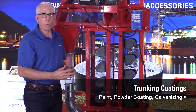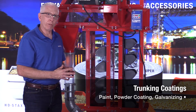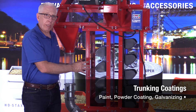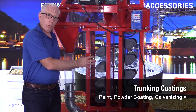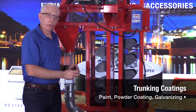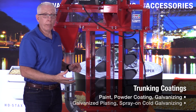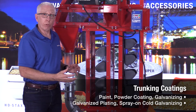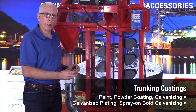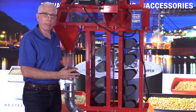Something to keep in mind if you want a galvanized bucket elevator is that it's very difficult to do a hot dip galvanized on trunking, because it can actually warp the trunking and it doesn't go up straight. So oftentimes manufacturers will use galvanized plating to make the trunk and then spray on a cold galvanizing to finish off and cover any welds, scratches, and things like that.